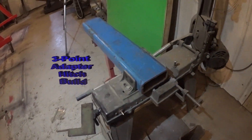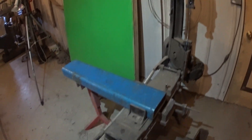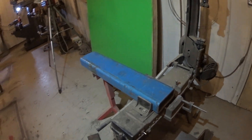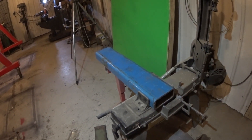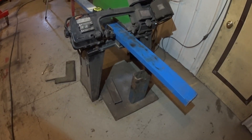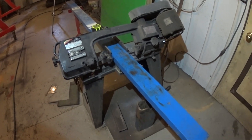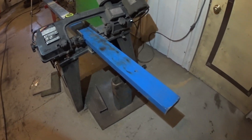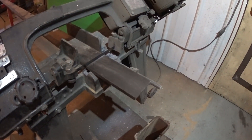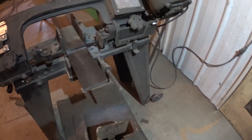This is the start. It's a little bit painful because my saw is not quite big enough, so I have to flip this thing over about three times to cut it, but it's done. First piece, the big one, is done. Now we're cutting two of these U-channels, and I'm going to cut a couple half-inch by three-inch by seven-inch each of the flat bars.